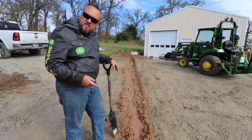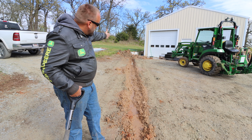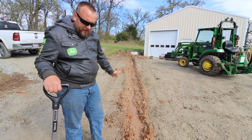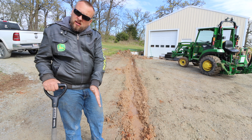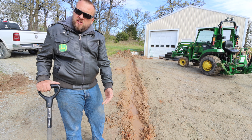The only video I've seen with digging a trench with the front hoe bucket, they were wanting a trench that was the same depth all the way. And I feel like I can easily do that. Trying to have this be 8 inches deep at that end and 0 here, I found to be more challenging, especially since you didn't have great visibility.